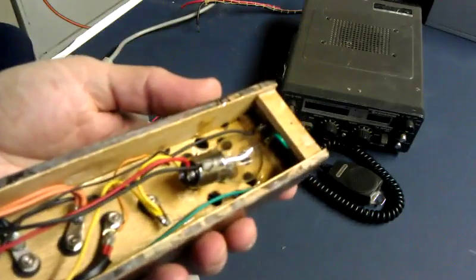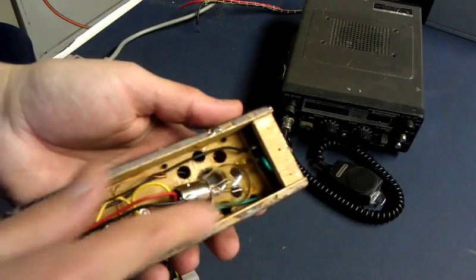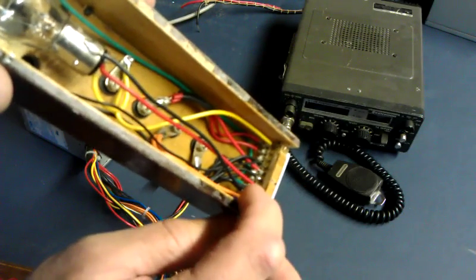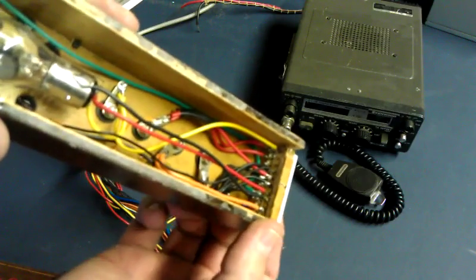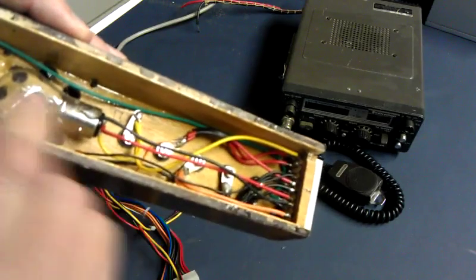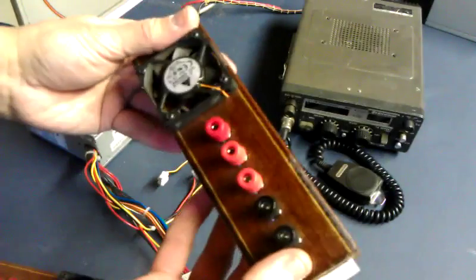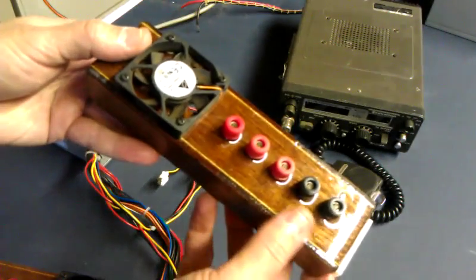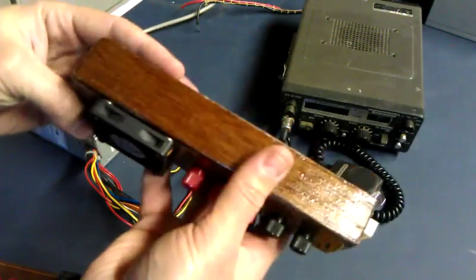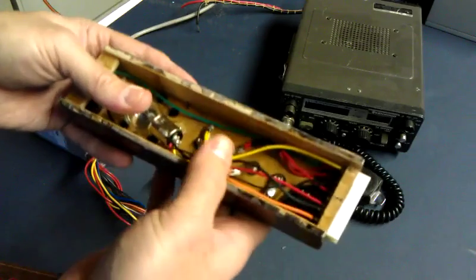The power switch is noteworthy. It's got a ground wire running up this side, and then this green wire coming up over here goes to the right pin in the ATX socket that signals the power supply to turn on. You can actually make these really simply if you just take a light bulb, an ATX socket, and a switch and just solder them together. But I decided to make a nice box — I coated it with epoxy, and it's just a piece of art really, but it's very functional and does a great job.